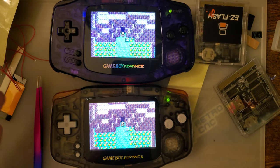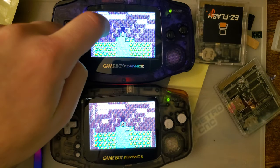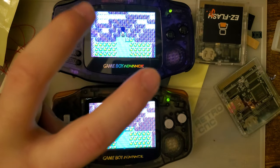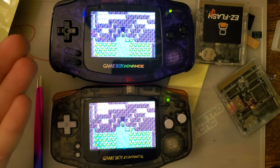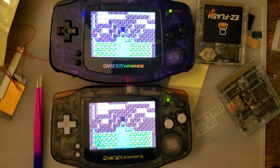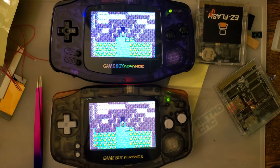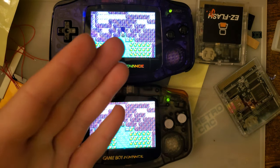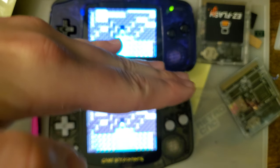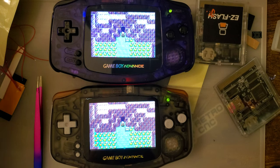You don't have to, like, this drop in screen, I had to modify this shell so I could drop it in flat. If you want to see what it looks like without modifying the shell, check out my video on the Cloud Game Store drop in LCD. I'll have a link in the description. Just skip all the way to the end. I did not modify that shell for the screen. And you can tell because the screen itself just sits at an angle within the shell, and it looks bad.